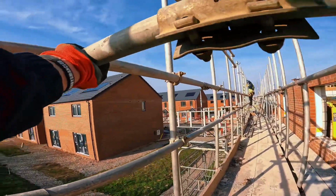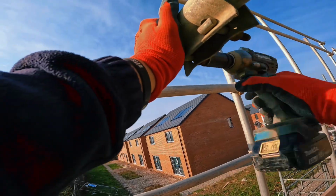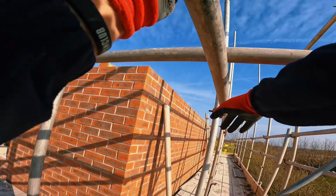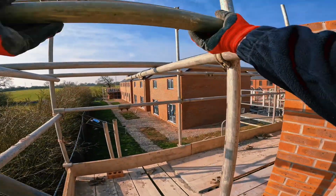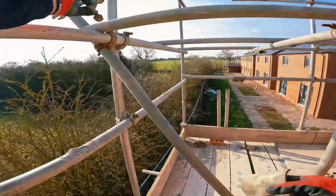Right, stick this button. It's a little bit big, but oh well. Some people now level this leg off this ledger. It just absolutely bends the ledger. So what I'll do, I'll level it from this 5 foot. It's nice and close, won't really bend the ledger. Single shouldn't be loaded out.